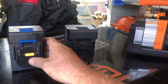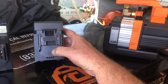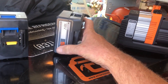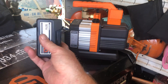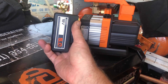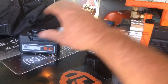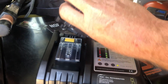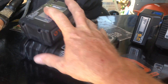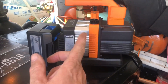But after talking with Andrew Greaves on the HVAC Shop Talk podcast, and then running a couple experiments myself — when I had one battery run out of juice and I put my second battery in, I did not put the exhausted battery onto the charger immediately. If I had done so, this battery would have recharged before this battery would have depleted while the vacuum pump was running.